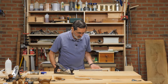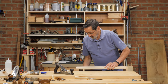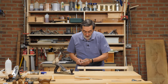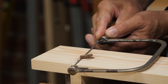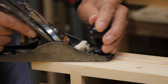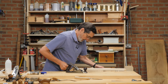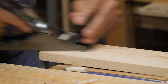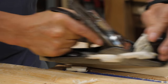An alternative way, I noticed on the other side, this wedge is protruding much more, so I'm going to lift this up to here and take my coping saw. What I'll do is I'll just rub that coping saw well above the surface, like that, and cut it off. And that works fine too. Drop it down, and just pare it down until you're flush,